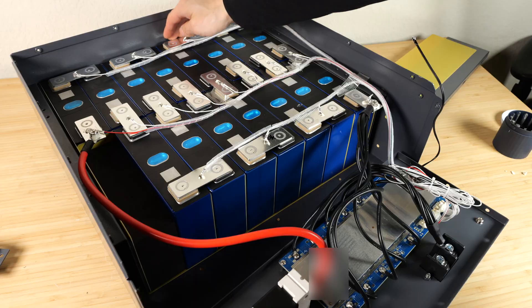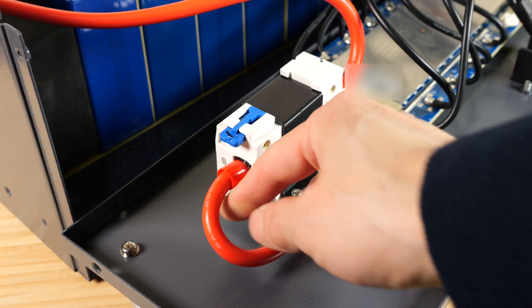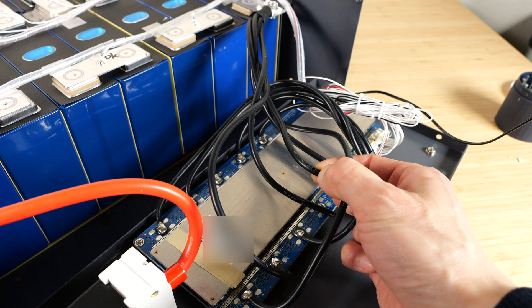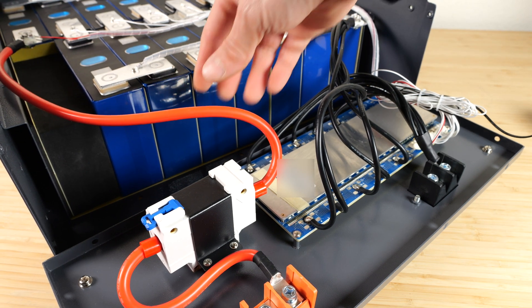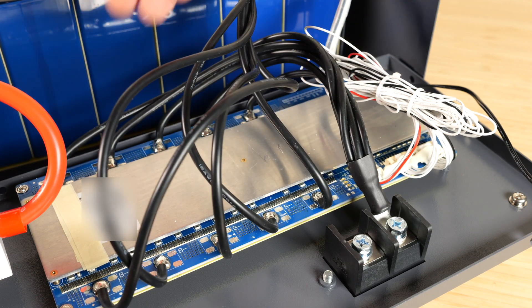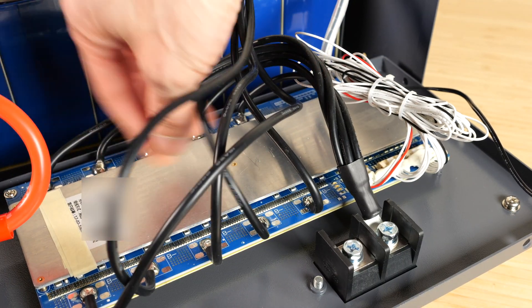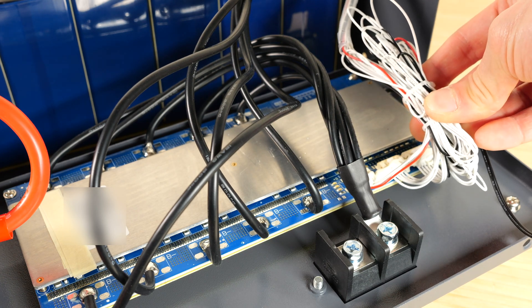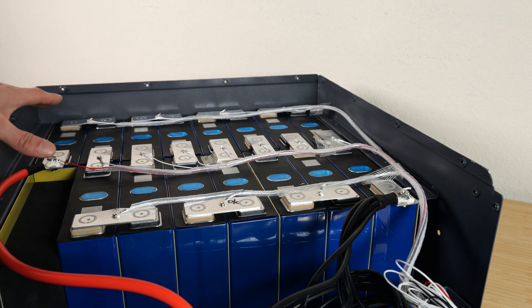You can remove this panel and the whole assembly should slide right out. The red wire is 6-gauge, 200°C capable, with a 13.3mm² cross-section. There are 5 black wires from the negative terminal — all 12-gauge, 200°C capable, 3.3mm² each, for a total of 16.5mm². So these will get a little warm being 6-gauge, but it's all within spec since the cable is 200°C rated. Think of the BMS as something sitting between the battery and the output terminal — it will cut off all connection between the negative terminal and the output if needed. There are FETs that turn on and off depending on battery state and temperature, and it does battery balancing using 16 wires that monitor each individual cell.